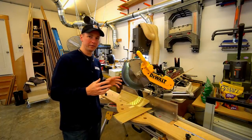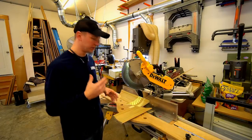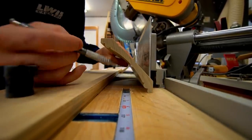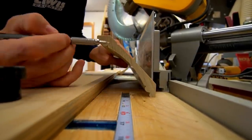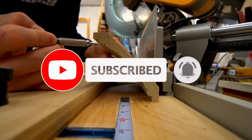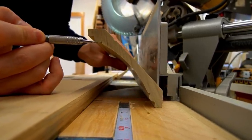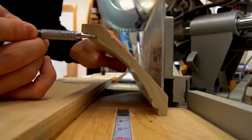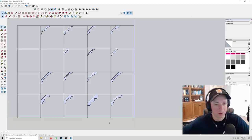Before we go to the end, I want to talk about how you can most easily identify crown molding on whether it's copable or not from the very beginning of the job. It's very simple. As you can see here, we have two beads on this profile. Whenever these beads cross the horizontal plane, the profile cannot be coped. This bead comes down to 90 degrees and then actually comes back up higher — that means it can't be coped.